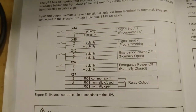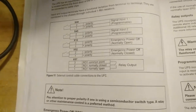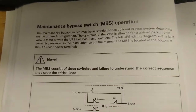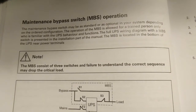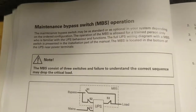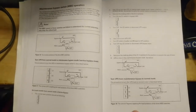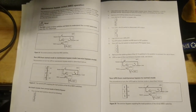The four green connectors were for programmable inputs and two outputs for emergency power off. A thing I noticed was the description for the maintenance bypass switch operation. The maintenance bypass switch consists of three switches, and failure to understand the correct sequence may drop the critical load — pretty important if you have a server park supplied from this UPS. They made a ten-step procedure in order to switch to maintenance operation, and you have to do this without stepping wrong or you will drop your server load.